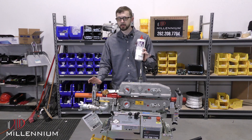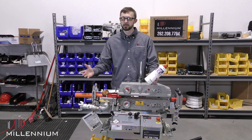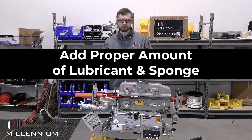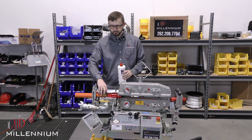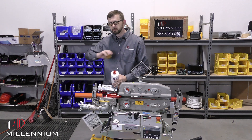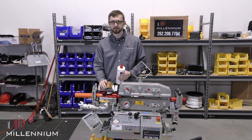You do have to use a blowing lube. There are a couple of options within that — you can get summer and winter. If you're going to be working in winter, the winter formula has a lower freeze point so it won't freeze up on you. So we're going to put the amount of lube we need inside of the duct, shove the sponge in behind it, close everything up, and do the same thing. We'll crank our air all the way on and let that sponge and that lube go down our duct to line the walls and clean out anything else that might possibly be inside.